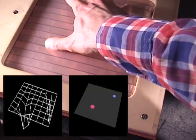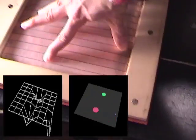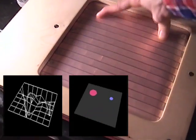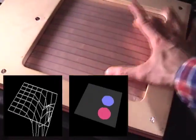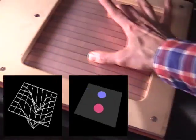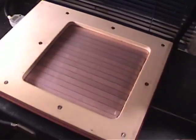This is one of a very few multi-touch controllers made specifically for computer music. Touch screen and FTIR based controllers generally have a sampling rate of 30 to 60 hertz. While this is good enough for visual work, demos, and games, you really need a sampling rate of around 1 kilohertz before you can capture the nuance of live musical performance. This prototype's sampling rate is 44.1 kilohertz divided by 32, or around 1300 hertz.